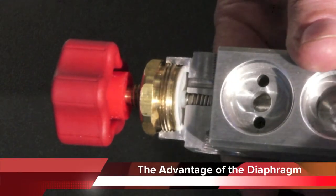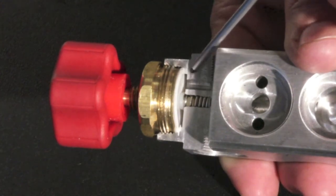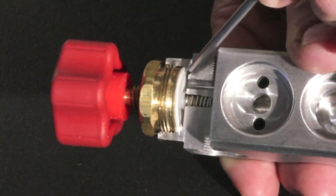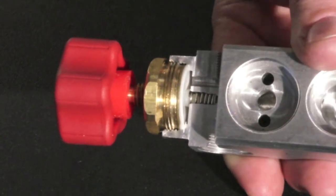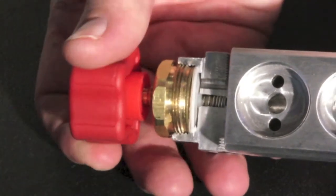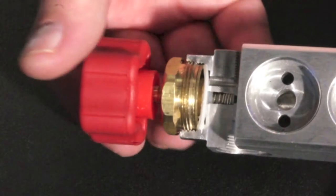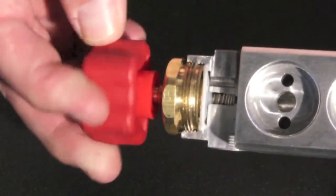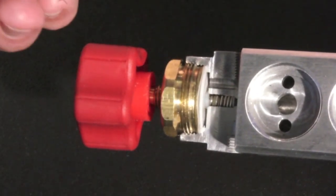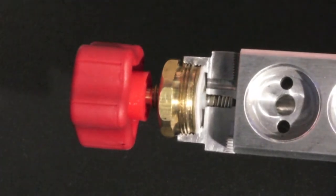This is a cutaway of our 900 series manifold. It's a diaphragm type seal, and diaphragms have a huge advantage over o-ring seals. This diaphragm flexes — don't let the small amount of space fool you because you have a huge surface area, and even though it's only open a small amount it lets a large amount of gas pass through very quickly. When you start to close it, it bends down and presses against the seat to create the seal. It's fingertip tight when sealed, and only about one full turn to be fully open with full flow through the porting.